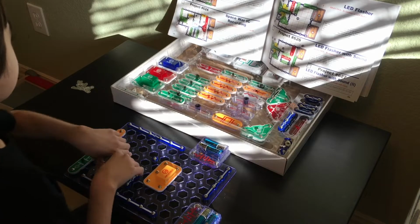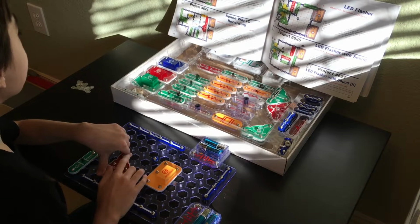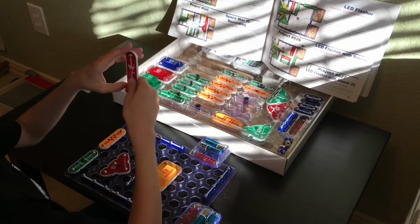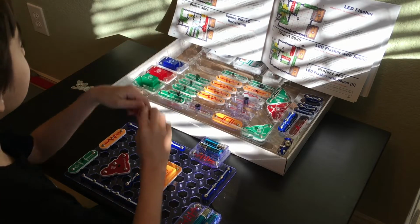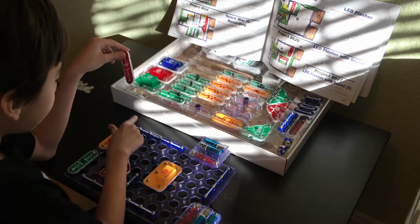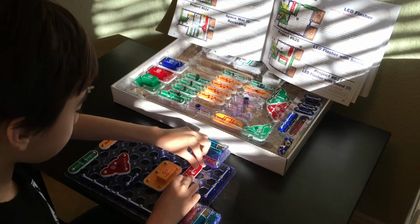Okay. And next we're going to be having anything else for all level 1 parts. Anything else? Yes, we're going to have a parade of LEDs. The D1 here. Orientation is very important. The plus needs to be over here, not over there. And it's going to be over at B8. 1, 2, 3, 4, 5, 6, 7, 8, just like this.